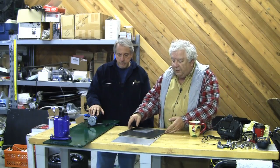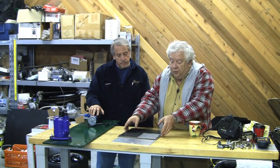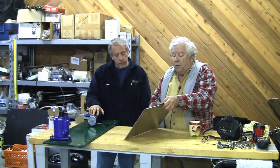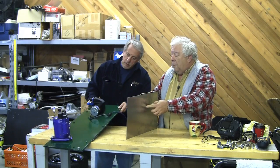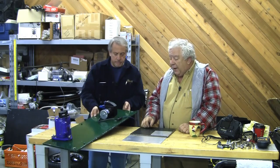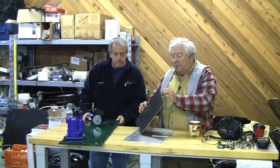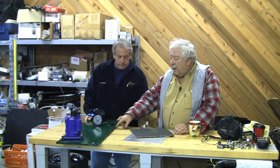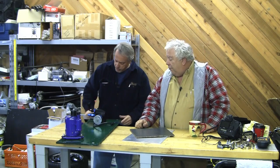What I did was took two pieces of the 6061 and made a sandwich with the carbon fiber honeycomb and the 6061, and simply bolted them together with some little quarter-inch, three-quarter bolts. I've got the little bolts right here. I've already got this painted. I'm not too sure about the edge of this — it looks like paper. So I went around and just dabbed on some five-minute epoxy to kind of seal and shield it up pretty good.